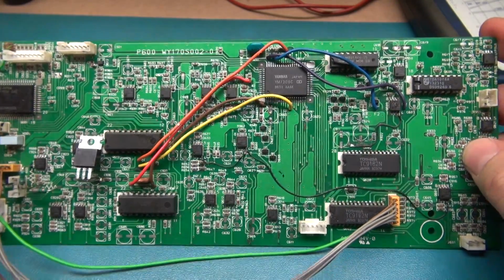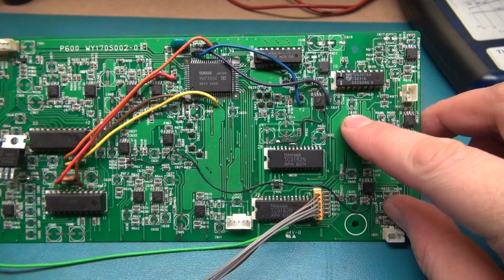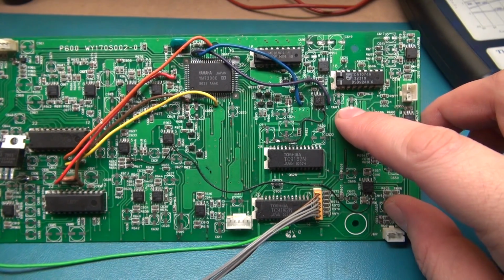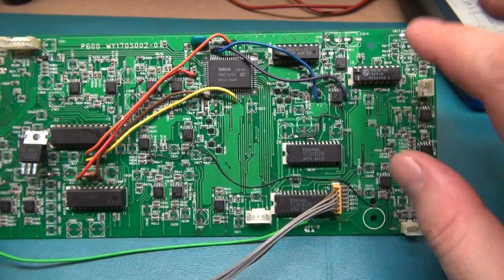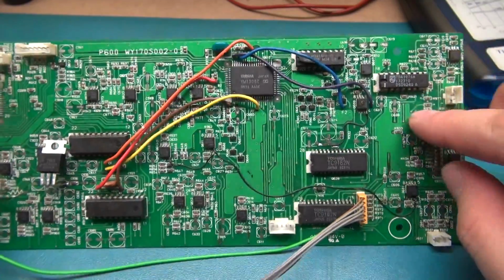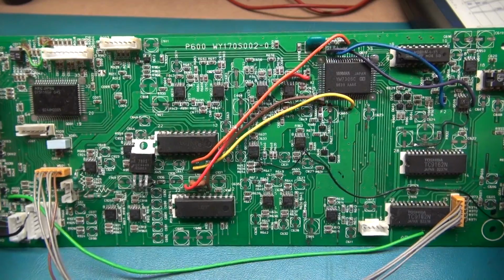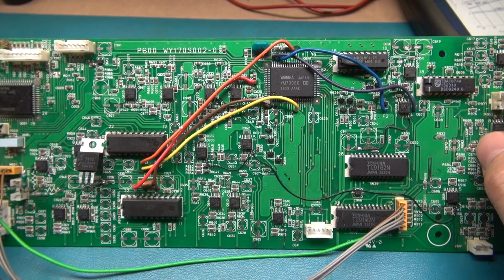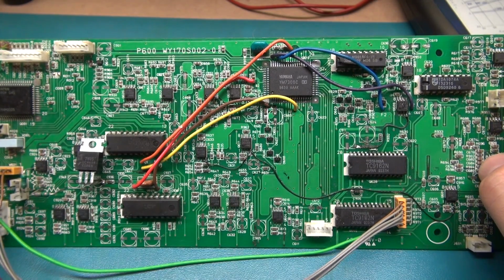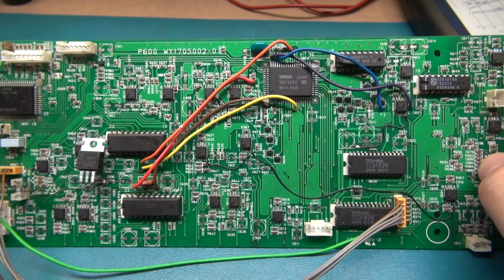I basically found a couple capacitors that were in question over here, where I've heated with a heat gun while it was operating, and I've got my center channel back. So I stripped all the caps off this board because I suspected that if these two are bad, then the rest of them are probably not too far behind, or there may be more in the same condition. I think there were between 60 and 70 capacitors on this board, and it took maybe an hour to strip them off, maybe less.